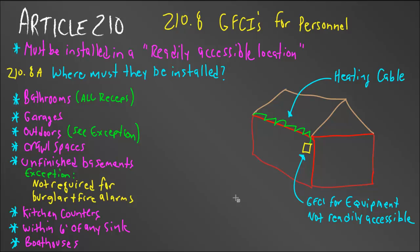Now let's look at the exception for the outdoor GFCI. If you have an outdoor GFCI installed only for de-icing or ice-melting equipment — such as a gutter de-icing cable up onto the roof — and that receptacle is not readily accessible, then you can use an equipment GFCI to avoid nuisance tripping. That's the only exception for outside. As always, I hope you took notes. If you need to go through this again, do so and make sure you take good notes. We'll talk about this more in class, and I will see you next class. Be safe.